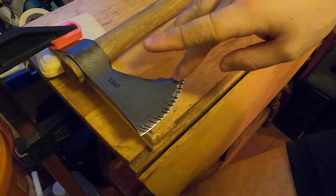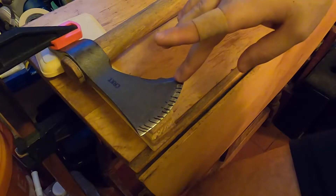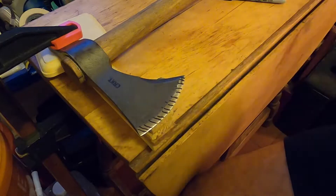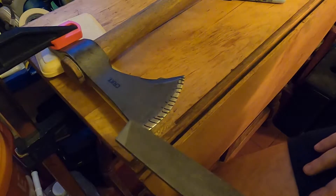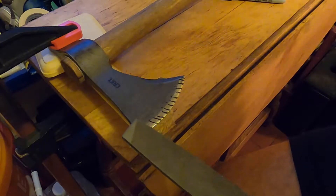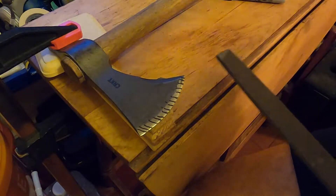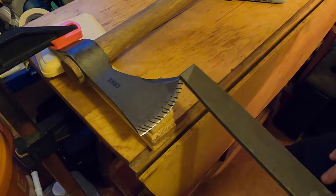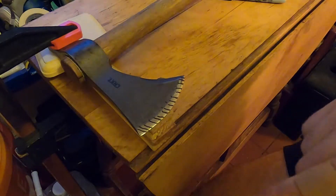Once the lines disappear from back here, I'm going to take that angle and bring it towards the tip. The blade itself is nice and polished right now, so if I'm still seeing polished blade, that means I still haven't hit that spot. I'll come by with the Sharpie from time to time to make sure those marks are consistent — until one stroke across takes off all the Sharpie marks or at least most of them.